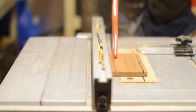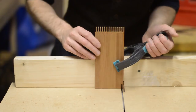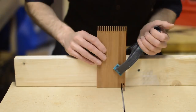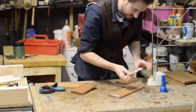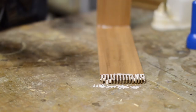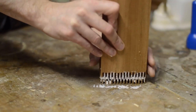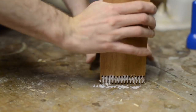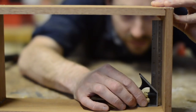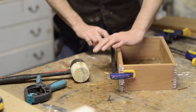After cutting all the wood down for the front, back, sides, top and bottom, I could start with the joints. I'm going to joint it all using a box joint using a table saw sled. The first cut sits over a pin that's the same width as the kerf of the blade. Then it's just a time-consuming process moving along making all the cuts. It feels like it takes almost as long again getting glue in between all those fingers. The good thing about box joints is they tend to pull themselves square, but I just had a little check before I got loads of clamps on and left it all to dry.